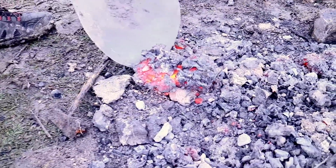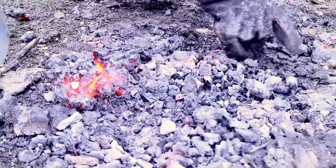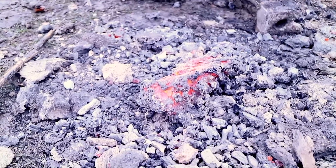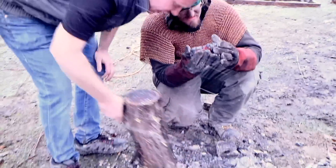This right here is kind of our little puck of iron, probably. This is probably the biggest chunk of iron we pulled out of here, with a few more smaller chunks. Hypothetically, that is the bloom. It deforms when we pound it — until it started just shattering. My understanding is that the test is that it needs to deform, not shatter.